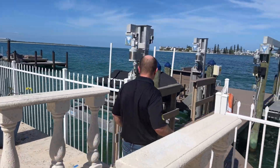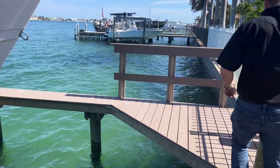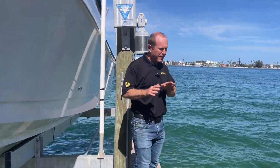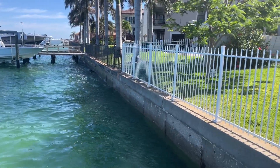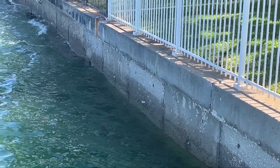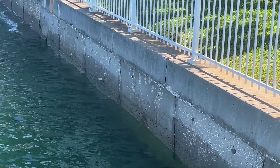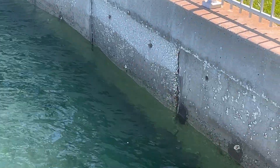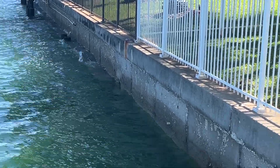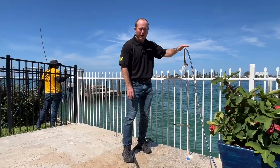If you look at the face of the seawall, you can see the lines running up and down the panels, along with small cracks and crevices. Typically those joints between panels are where the soil is eroding out, possibly down below at the foot of the seawall. We go one foot down below the mud line and treat the soil as we work upward. This is where the seawall typically experiences soil loss.